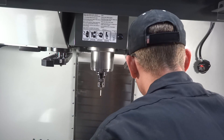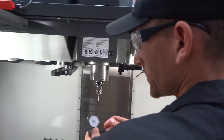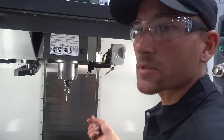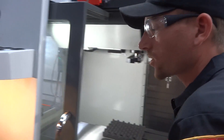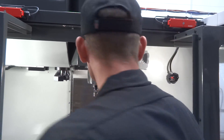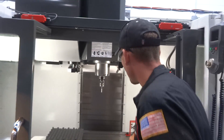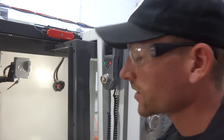That's what you want to see, because if you get any more run-out in it and say you have an operator that pulls this out of your spindle and gets it in 180 degrees around — when this thing calibrates, it cals out the actual run-out that's in it. So that's why you want it close, so after calibration is done, if you take this out and spin 180, that's going to be off. That's why you want it as close as possible. Same thing with the top — make sure that's straight and we're getting real close, within tenths.